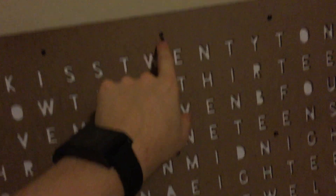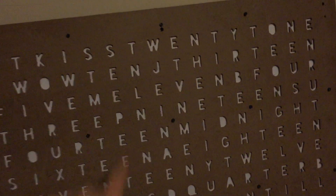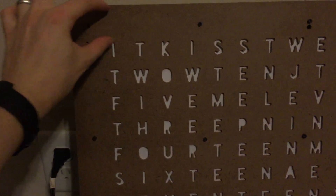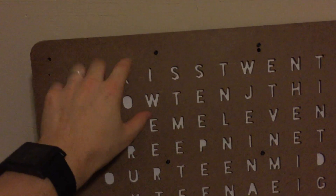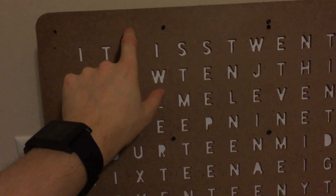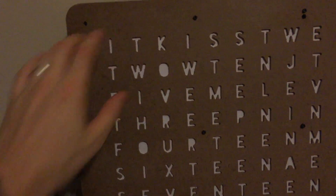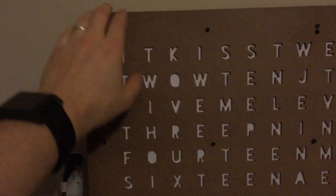I've also got a light sensor up here that's got a light sensor barometer, and another sensor connected over I2C to the Arduino, which sits about here. And then there's a Raspberry Pi Zero that sits here. It connects over USB OTG cable to the Arduino. The Raspberry Pi Zero has Wi-Fi and will run Node-RED, so I can do a lot of IoT functionality with it.